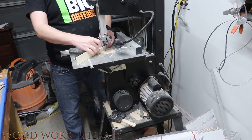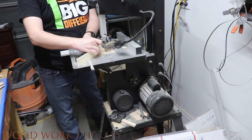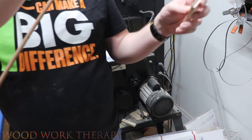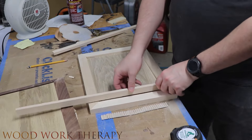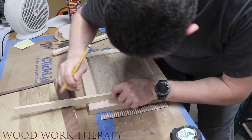Now we're going to make little feet. These allow you to use those little stairs we made earlier, which will make a lot more sense later in the video. Those are also cut to 45 degrees, and then a little round-shaped cut was made to fit a quarter-inch walnut dowel. Basically the dowel just fits right in there, and that's pretty much it. This is going to be our top bracket — this is where the dowel will actually connect into.